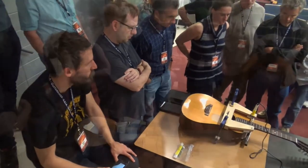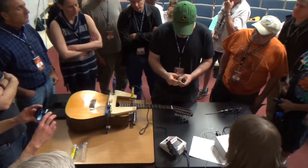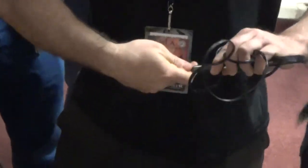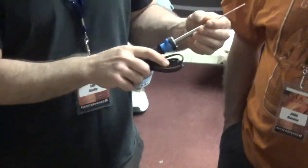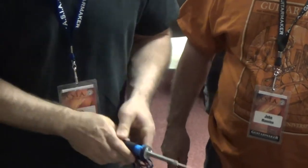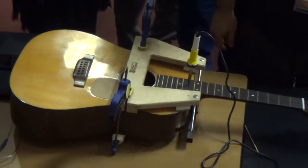Your number's like 28 right now. Yeah, so this is sunk down in there. Dan says it works in this guy. It works in a couple different manufacturers' soldering pencils. Like this one, the original, I had to thread this and get this in here. So every soldering pencil is different. You can get this into a Weller if you bore a hole in the end and slide it over the element that's down inside. But that's not a cartridge here, that's just a copper rod turned.